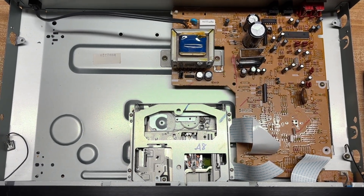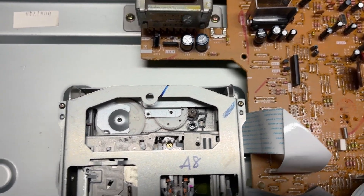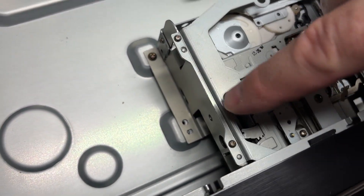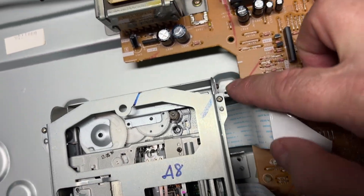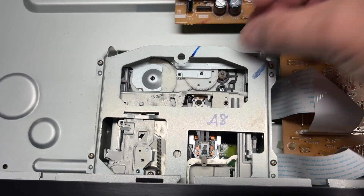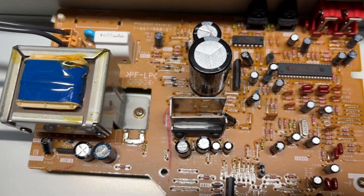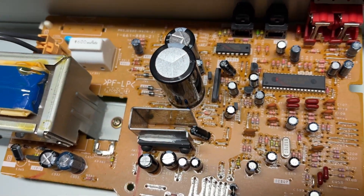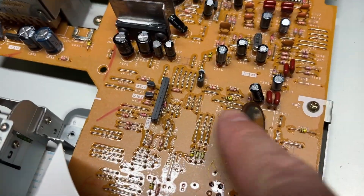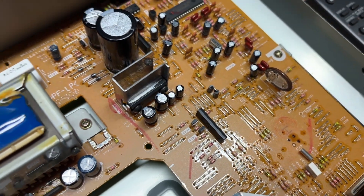Here's what the inside of this unit looks like. One thing I noticed right away is that it has a smell — it smells like cigarette smoke. It was like opening up a tomb of cigarette smoke. This looks like it has been worked on before: there's a screw missing there, and two screws missing here for the deck part, so there's literally one screw holding this whole thing on. No obvious capacitor leakage going on. It looks like it also has a battery backup — that battery is probably toast, but we can test it and find out.